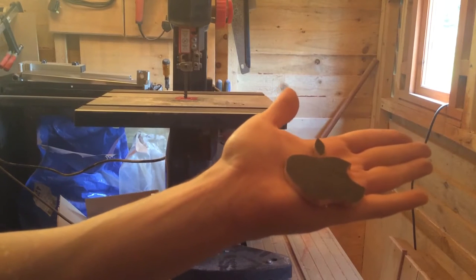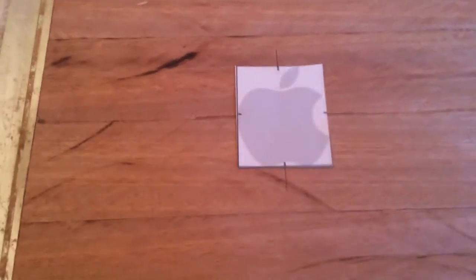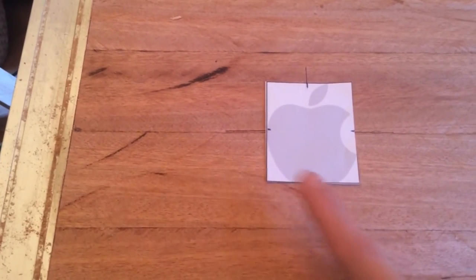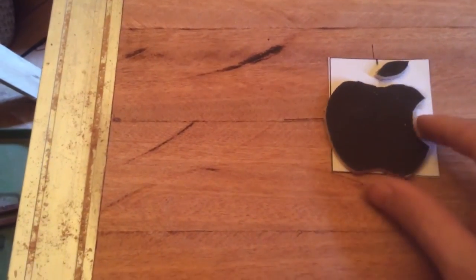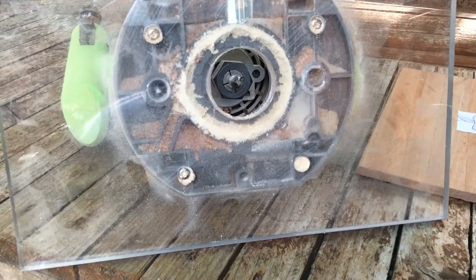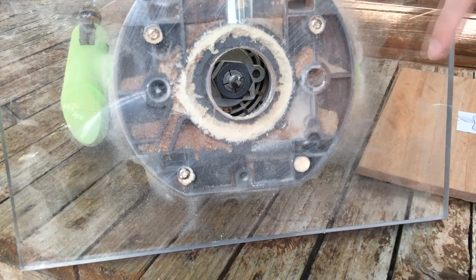And there's the finished logo. To help with alignment I've printed off another apple logo but this time in a light grey colour. I've marked the centres of the blank board and also the centres of all four sides on the apple logo — so as long as those marks all join up I know the apple logo is dead centred. I shall take the piece that I've cut, lay that on top of the logo, and trace round with a pen so I know it's tracing the piece I've actually cut, just in case there are differences to the original image. Then I can router that out. I've installed the smallest straight cutting router bit I've got and set the depth to match the thickness of the oak inlay. I can now use that to cut out the apple shape on the top.